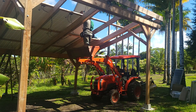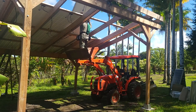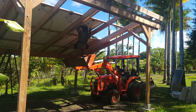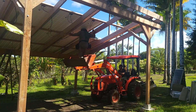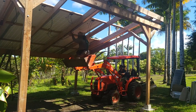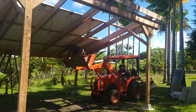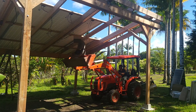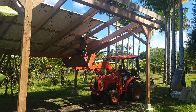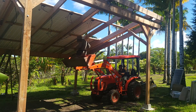I almost have more confidence in the strapping than with the lag screws themselves. Instead of using lag screws that would have left rather large gaps we'd have to waterproof — which was not ideal — butting the panels together leaves a much narrower gap to deal with. We originally tried silicone caulking and silicone acrylic caulking, but every time we tried to waterproof the system it rained. The caulk never really had a chance to set up and it just created a mess all over the panels.